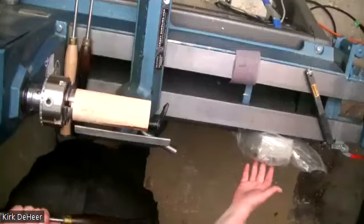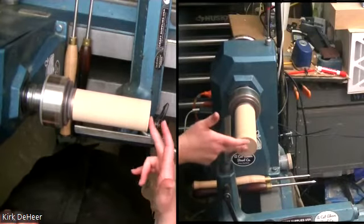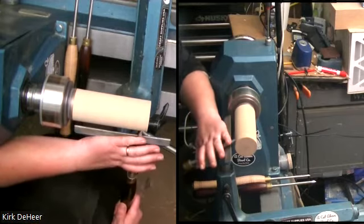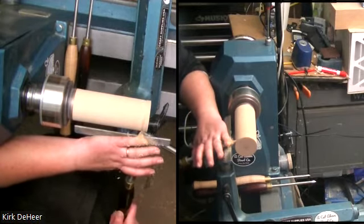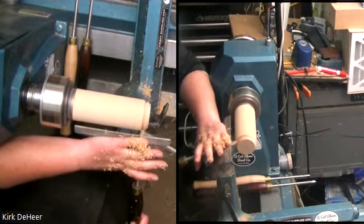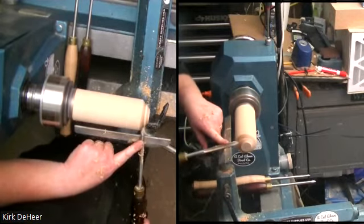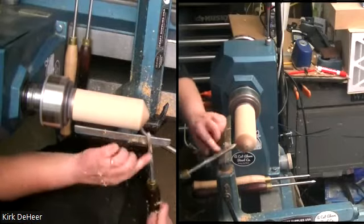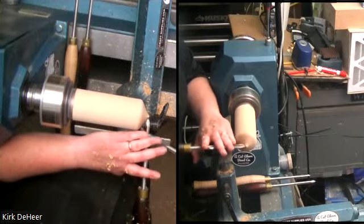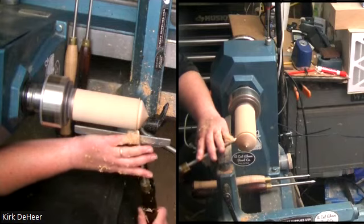This piece is about two and a half inches round. We're going to rough it over — start riding, picking up that cut, ride the bevel, and just remove material. We're just going to let the tool do all the work. We're riding the bevel down at a 35-degree angle — that's what we're aiming for with our top. Starting with just one plain jane top right here, we're going to roll the edge over.